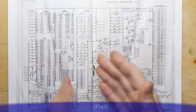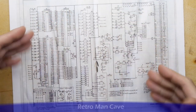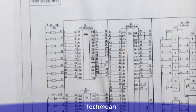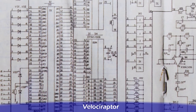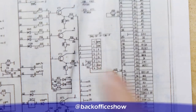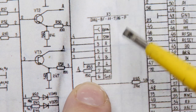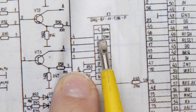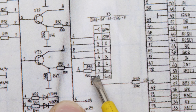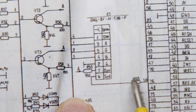I had a look on the internet and found its entire schematics — judging by the size of this staple, this would have been a little booklet that came with it. It's a little ghosty in print but just about legible. If you search through it you end up at what I firmly believe is the output section: sync on pin one, red, green, blue, then a ground, a composite output which would probably be SECAM which we're not going to use, and then sound going off elsewhere.